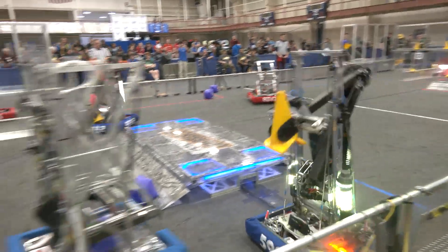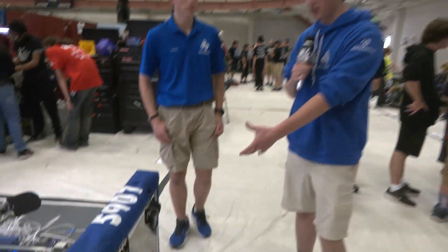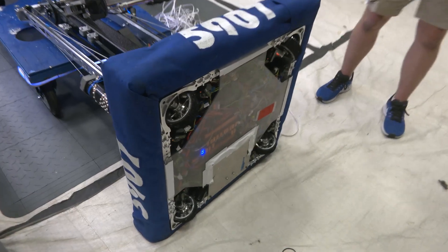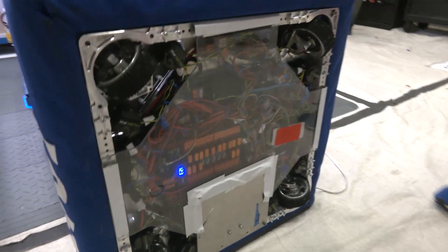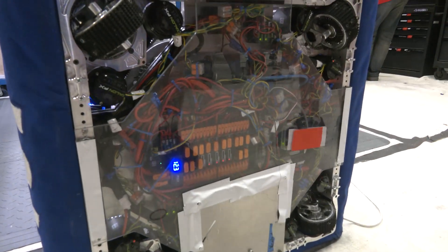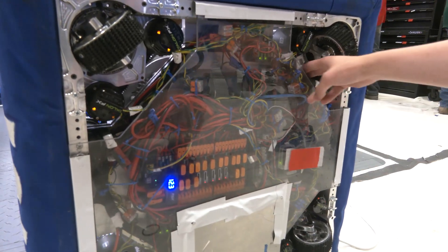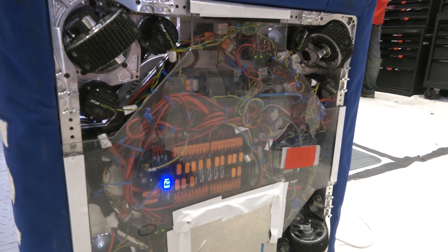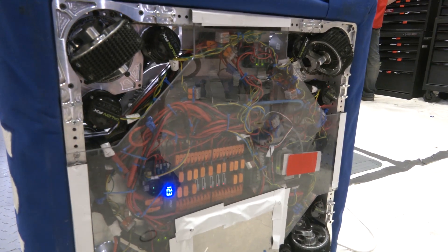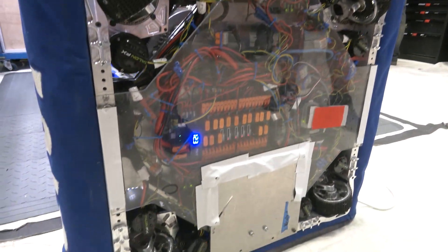Andrew, I noticed that you flipped over your electrical board — let's take a look at that. Because of our compact size this year, we had to switch to an upside-down electrical board. With the compact wiring, we have the main power distribution system and the RoboRIO over here. With the swerve modules, all of these are loomed together and also at a common disconnect point, so if we ever need to change a swerve module, we can quickly swap out the CAN and the power.